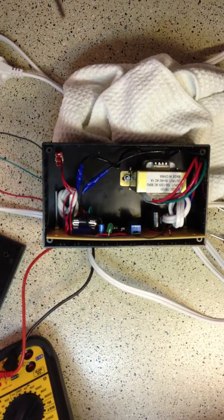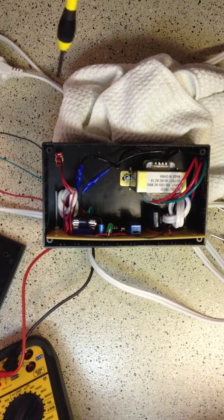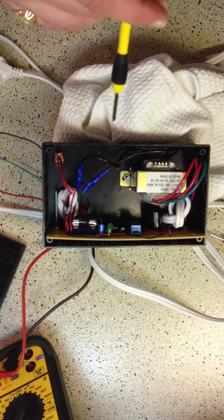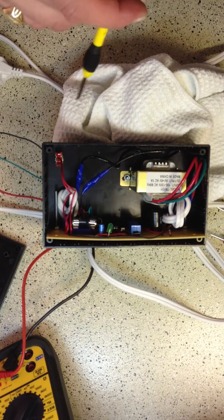So all that happens is when the water level gets too low, the PIC senses this based on some inputs and the water turns on. And then when the water level reaches a sufficient height, the PIC turns it all off again.